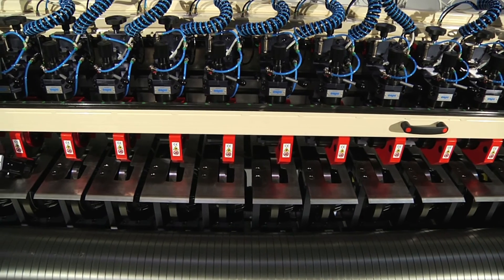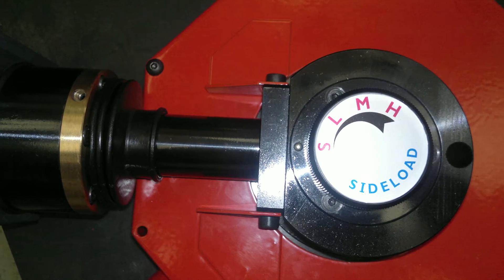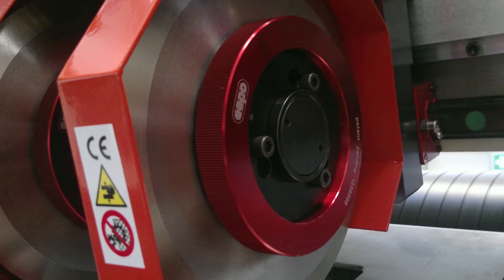Simple setting of vertical knife stroke and axial side load by knobs and spring load flange. On the knife holder there is a flat circular knife and on the bottom a T-shaped bottom knife, both realized in our production area.